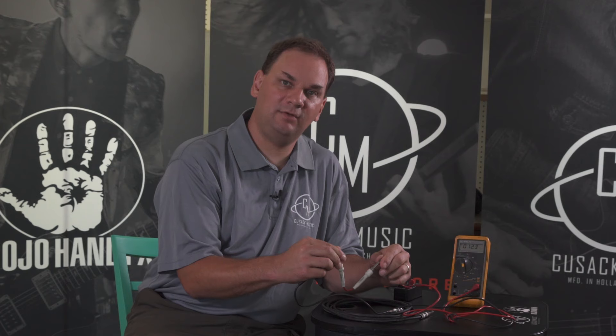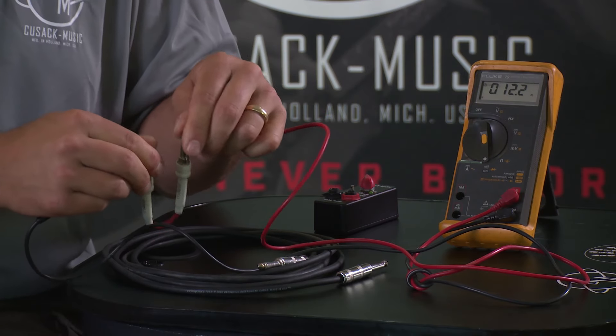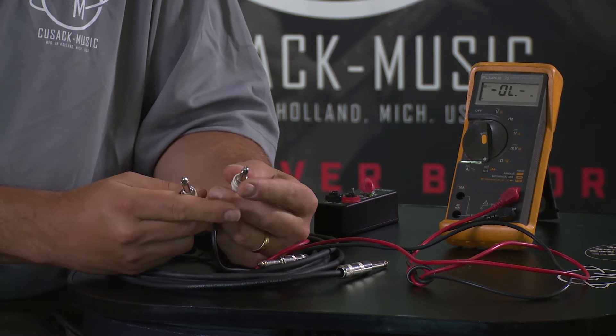According to this I have a good cable, but if you look at the screen I have 12 ohms of resistance on this particular cable right now. So 12 ohms is well over one ohm — that's a sign of a bad cable.